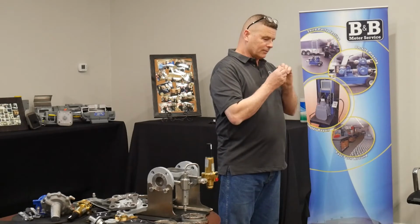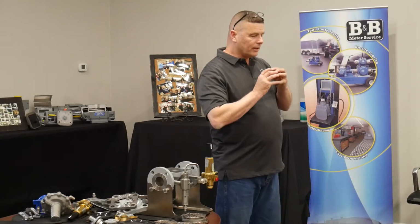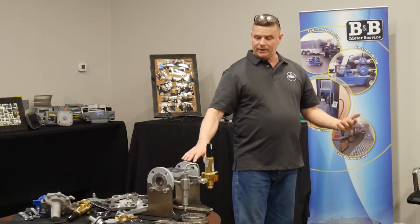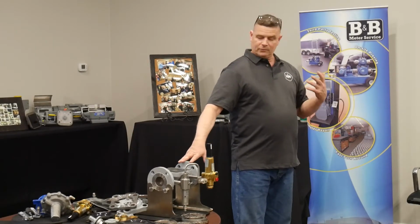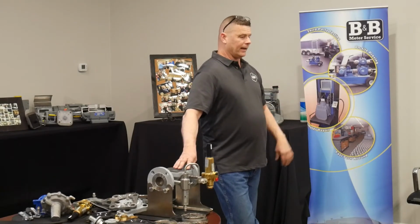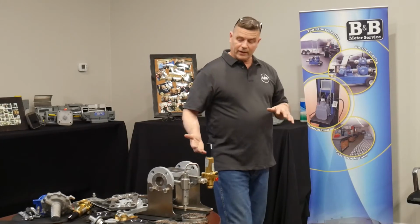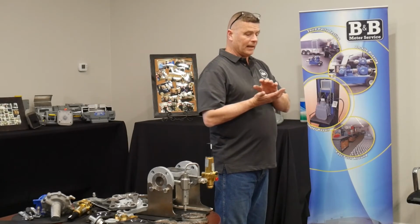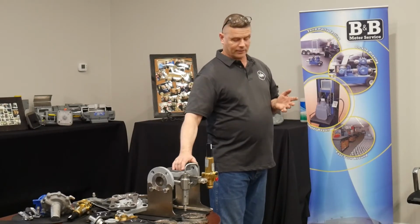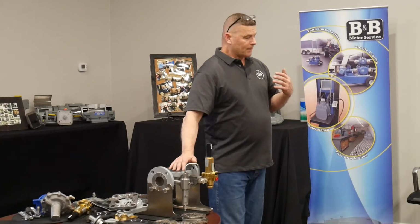It finds little particles of gas, it gets bigger, it separates the Buna and nylon, basically works its way out, just like a diver getting decompression sickness would, blocking the blood flow to your brain, and you die. So the diaphragm's doing the same thing. If it just sits there after it's been under pressure for a long period of time, it will basically deteriorate in its ability to still be in this regulator.